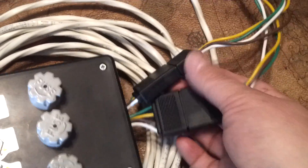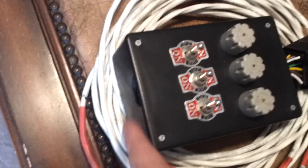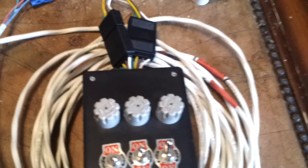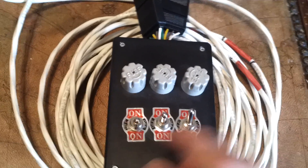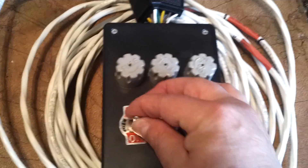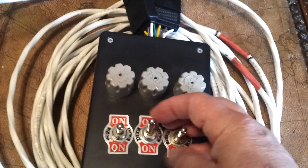The control box was designed so you could disconnect it as well. We didn't get to the point of adding a 20-amp fuse — each motor is rated for 5 amps and there are four motors, one on each side and two in the middle, so that's 20 amps total. On the remote: left turn has one motor forward and one reverse; right turn has the opposite. Both motors reverse for backward, both forward for forward, and the center controls up and down thrusters. Each motor circuit has a 5-amp fuse.